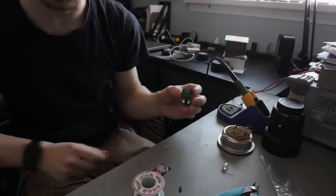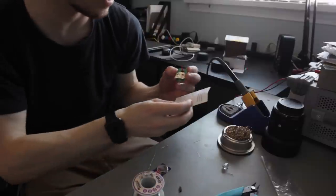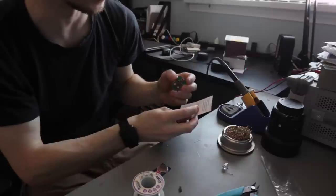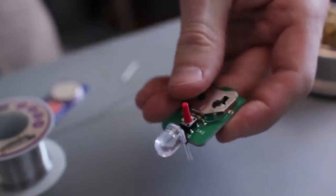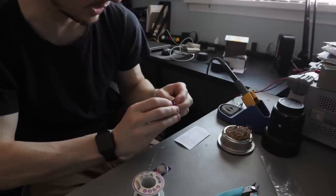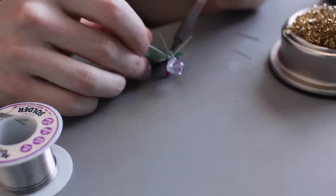Okay, so we got those three components on. Step 5: install the LED and use the lead bending tool as a spacer to hold the LED in the correct position. Note the direction of the long leads — the long lead is on the right. The reason we have this spacer is so that the LED will align with the 3D printed housing after. That'll hold it in place, and we'll solder it on.